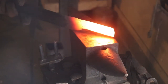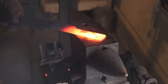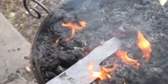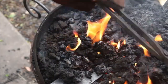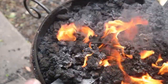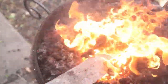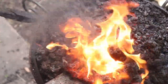Now I'm going to draw out the tang a little bit — it's a little thick and a little short, so I'm going to lengthen it out and widen it up a bit, especially at the base, so you have a little bit of a shoulder where the handle meets the blade. It's all forged out, nice and straight — everything looks very good. I'm going to do a little backyard annealing here on the tang just to make sure I'm able to drill holes in it. You could punch and drift them instead, but I usually only do that if I'm trying to get more width on a tang that's a little too narrow. I'll bring it up to critical temp, then turn off the forge and let the fire slowly go out — it should be soft enough to drill pretty easily.